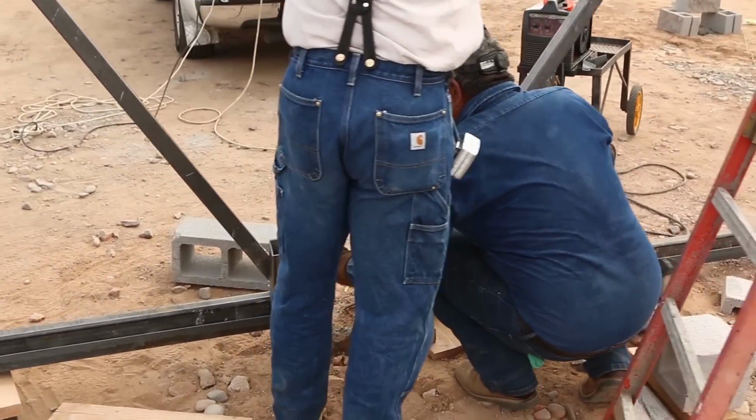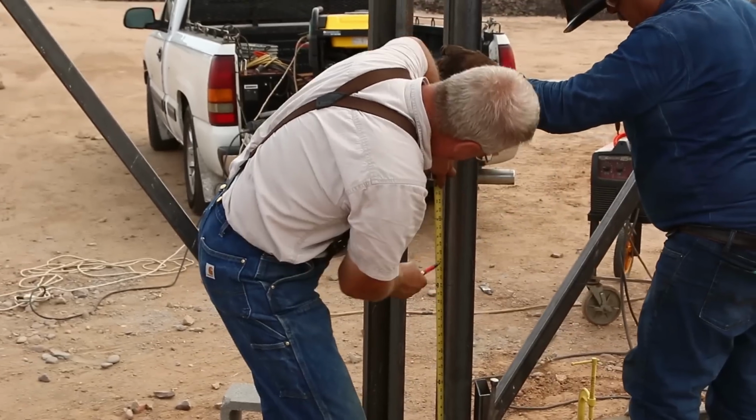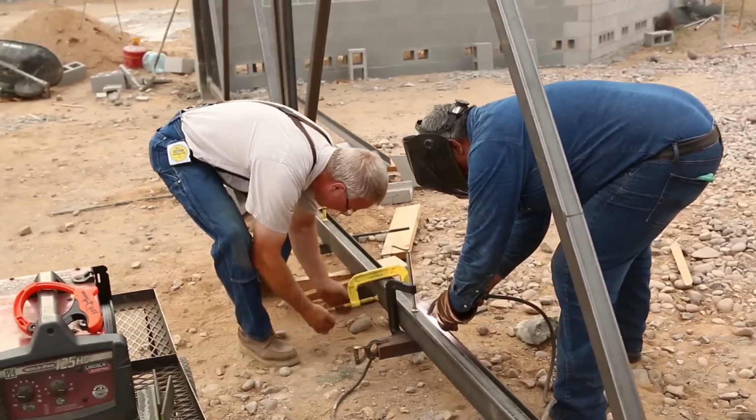The control issues were that the posts had to be plumb, they had to be the right distance in the ground. The gates had to be set to the right height on the posts so that they cleared the finished grade. When the grading was done, that was determined off of the hubs, the whiskers, the blue tops that we've already talked about that were in place. We don't want these things dragging.